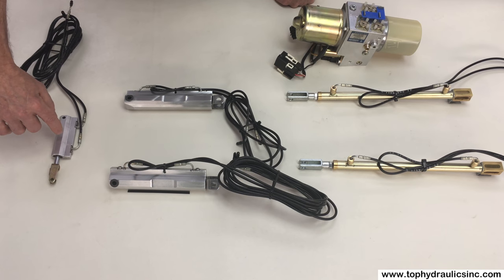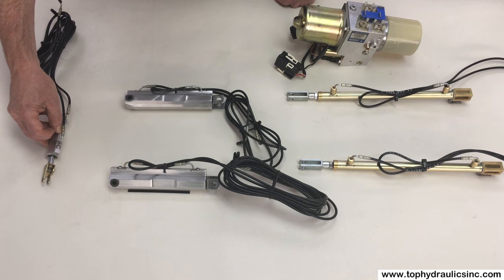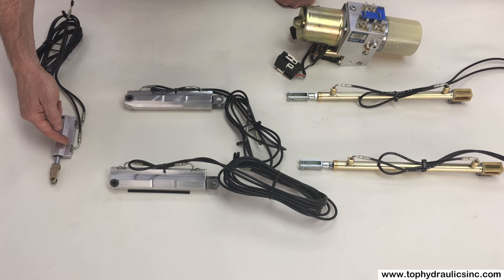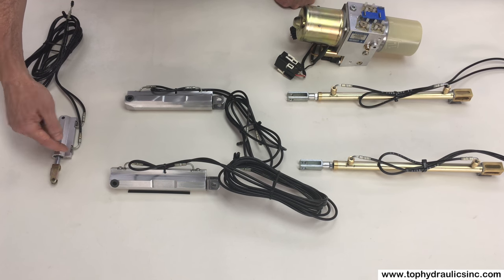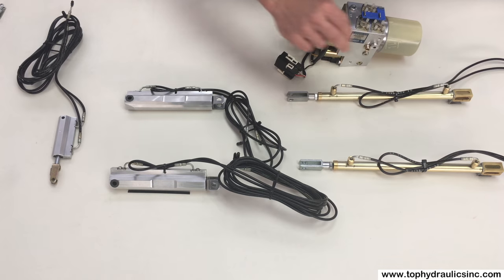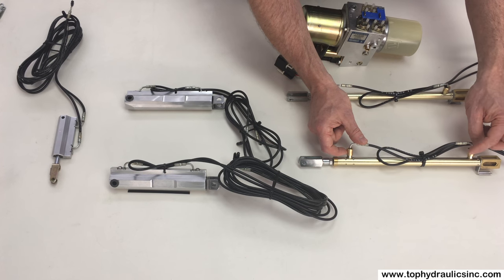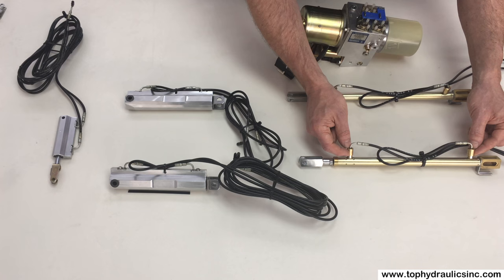What we do at Top Hydraulics is put the cylinders into a CNC machine, machine around the original crimps, pull out the hoses, and replace the port seals with viton, which practically has an indefinite shelf life. We then refasten the hoses with laser cut stainless steel clips. There is also a bottom seal for the bottom plug on the trunk cylinders. We machine out the crimps on the cylinders, pull the hoses out, and refasten the hoses with CNC machined caps.